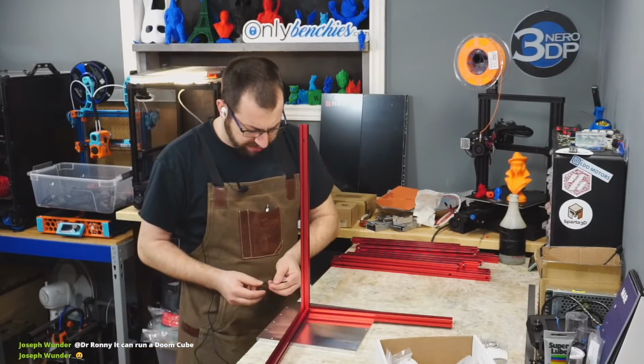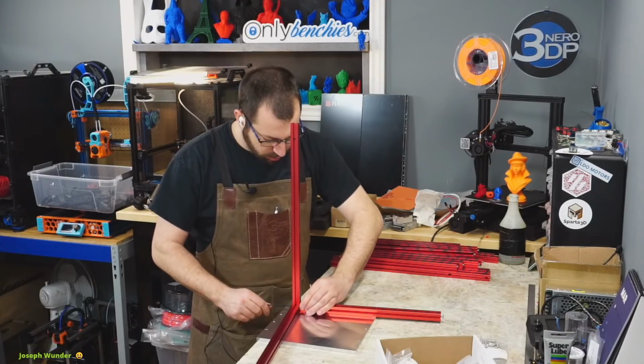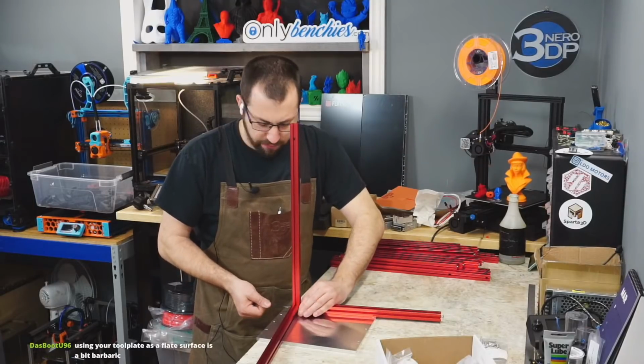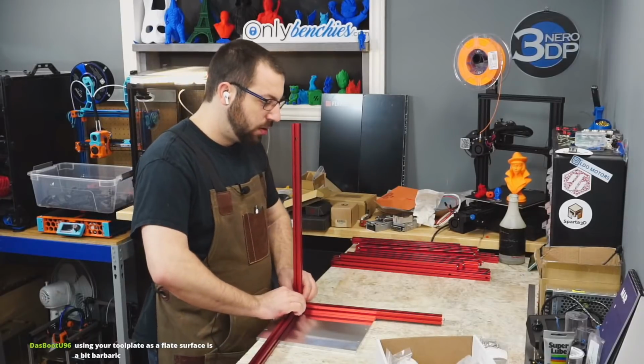What's the difference between a 10 and 25 amp? One's a 10 amp, one's a 25 amp. With your mains bed, even at 110 volts at 500 watts, I think you're not even pushing 5 amps. So.